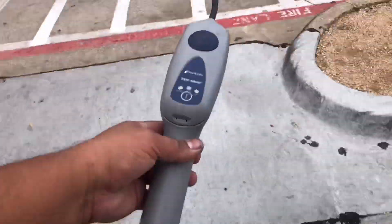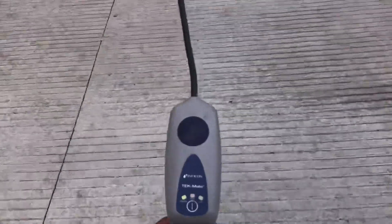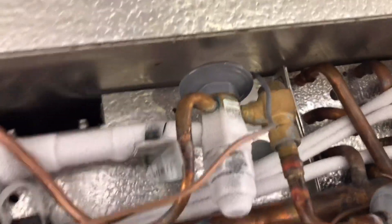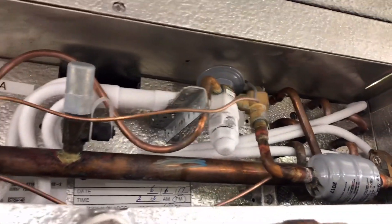The H10 died, so we go with the trusty old backup — this thing has never let me down. I know a lot of people hate it because it's only 200 bucks, but it gets the job done. All right, so we have found one of the reasons why this circuit is running horrible. This valve is completely — either the screen is plugged up or this power head probably lost its charge, one of the two.